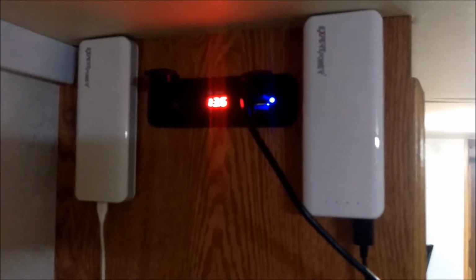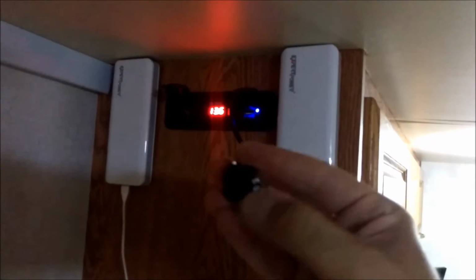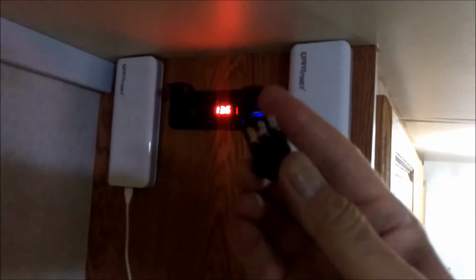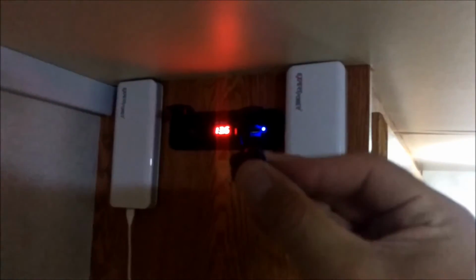And I got the HOTSYSTEM. Let me show you. These HOTSYSTEM LED switches. But I'm going to try not to hook up the LED. I really don't need it to light up. Also these cheap switches, from what I understand, they tend to get hot, use a lot of power, and they burn out anyway, the LEDs. So I'm just going to not hook up the ground leg, and actually the ground is the brass one here, and just hook up the power and see if it works. Hoping it does. If not, I'll hook up the ground and it'll light up when it's on.